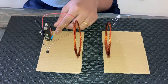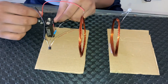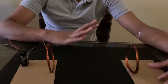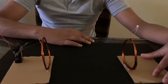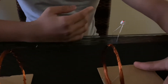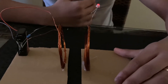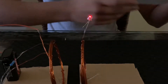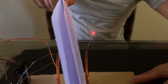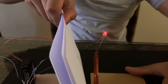The energy transfer system is done — let's connect and see if it works. I've turned off the light so you can see it more clearly. The closer I bring the receiving coil, the brighter the LED becomes, and when I move it far away the light goes out. I want you to see that there is no connection between the coils — I've put a piece of paper between them — and still, closer means brighter and farther means dimmer.